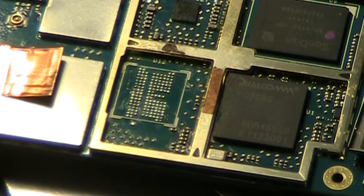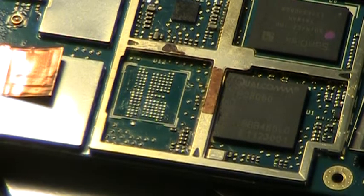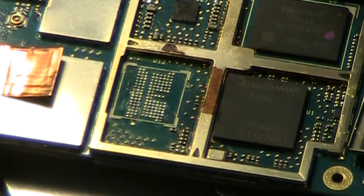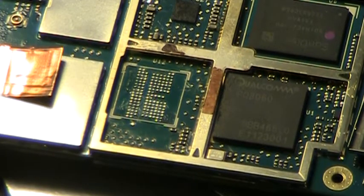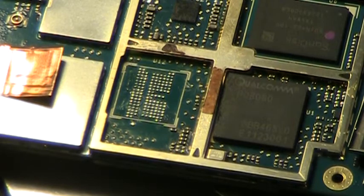I think I figured out what happened on the first chip. Once I took it off and took some pretty good pictures, there was a row on this far edge of the pads — on the actual chip itself — the solder balls weren't melted. So there were about two of these edge rows that didn't really melt. Even when I took off that chip I could see what was left — there was almost no solder, it was really gray. And there were about four to eight solder balls on the back of the chip that were still there and obviously hadn't melted.